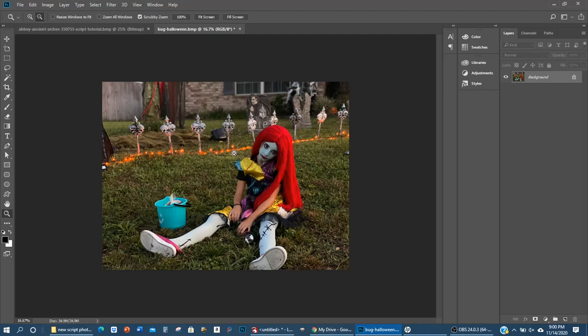Typically when I move up to higher resolutions I need less speed and less power. You just have to finesse your settings to match exactly what you see in the processed photo on your substrate. If you're burning too much away in the blacks, you're going too slow or you have too much power, or maybe it's your focus.